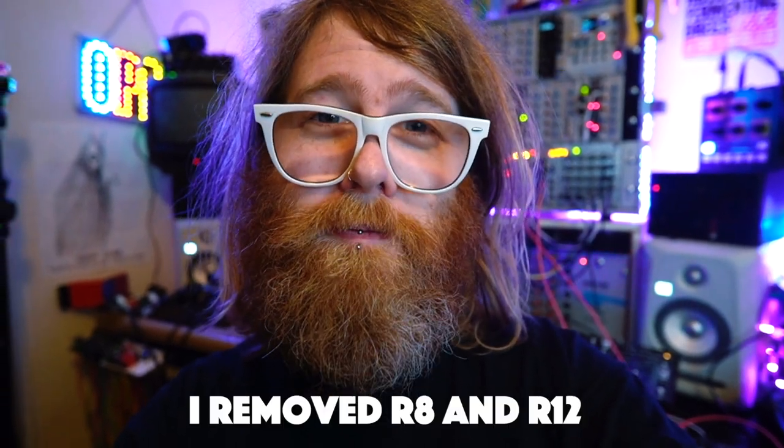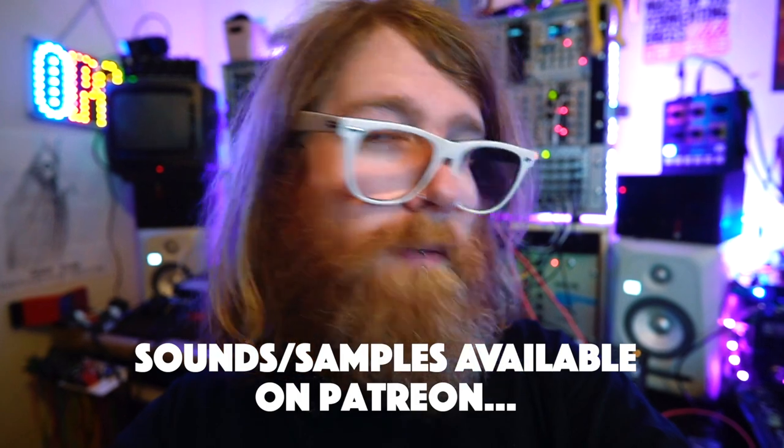If you do have a DR-55, I can't give you too much information on exactly what I did with this because I started doing it a while ago and then had to work out what I was doing when I picked it up again. But for the bass drum modification, you remove the resistors R8 and R9, I think, or R8 and R12, and you basically replace them with 1K potentiometers and 100K potentiometers. And there are guides online. Different people do different things, so you can easily look it up and see the kinds of things that you want. Anyway, I'm going to go and try do something with it and then you can hear what it sounds like in context.